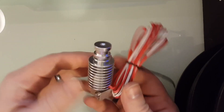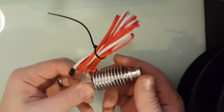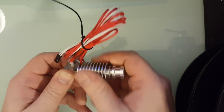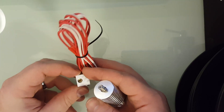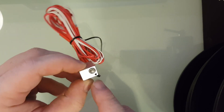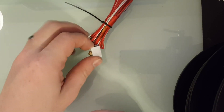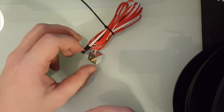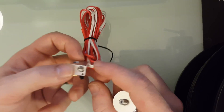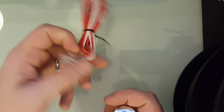Briefly, let's look at the V5 clone. They're the same price, and it doesn't make a whole lot of sense to buy the larger, bulkier version, but it's interesting nonetheless. It's basically the same design with two small differences. First, it uses the V5 block with a set screw to hold the heater cartridge in. The heater cartridge is the proper diameter for good thermal contact, but those set screws don't have strong threads. The reason V6 replaced this is better clamping force with an M3 bolt squeezing slit halves, rather than just pushing a heater cartridge in with a single grub screw.